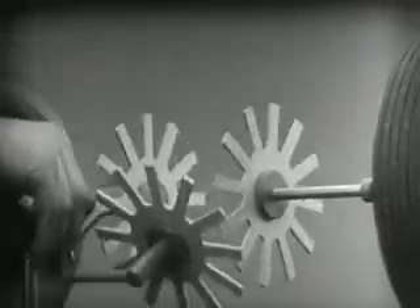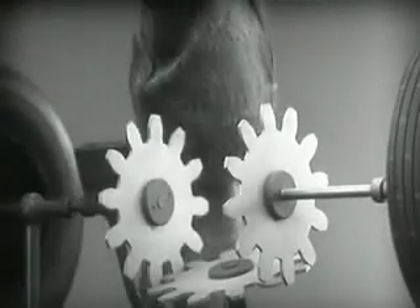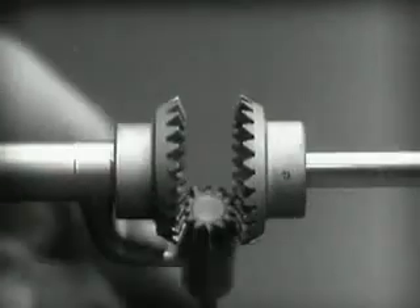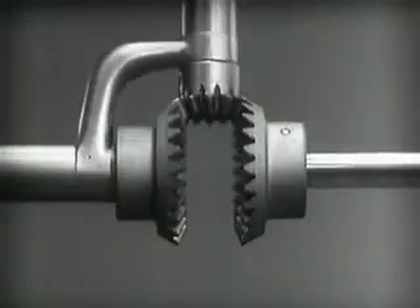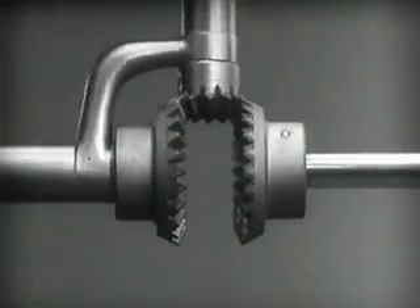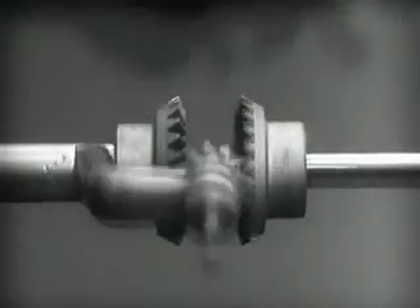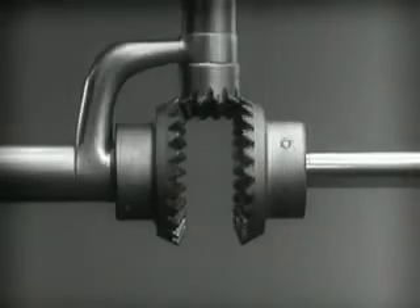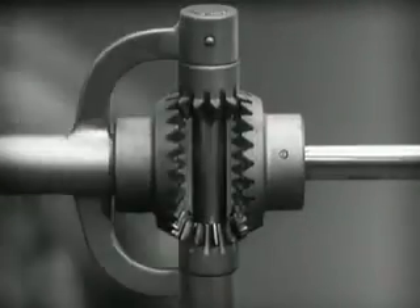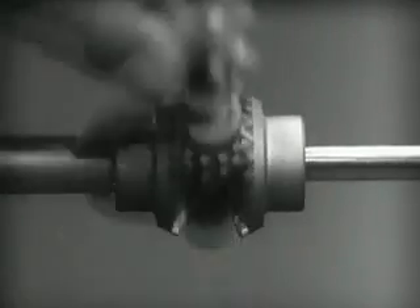And changing the shape gives firm, constant contact. Now we can make the gears thicker and stronger, and we have differential gears. The edges are cut so that they will fit together more smoothly and silently, and another gear is added to share the work of driving the axles. The principle is the same.